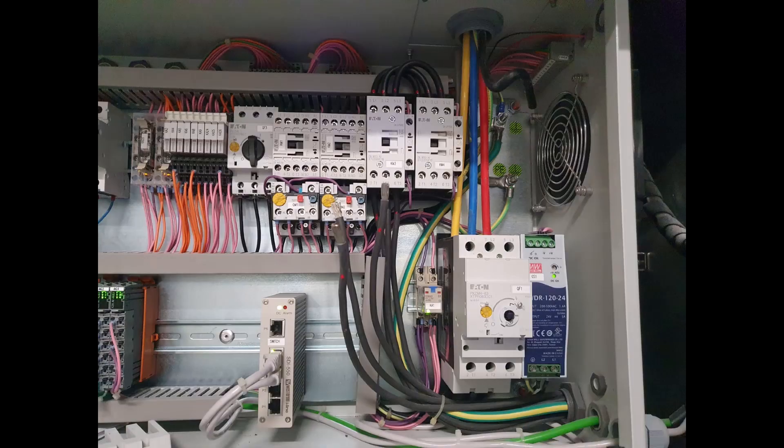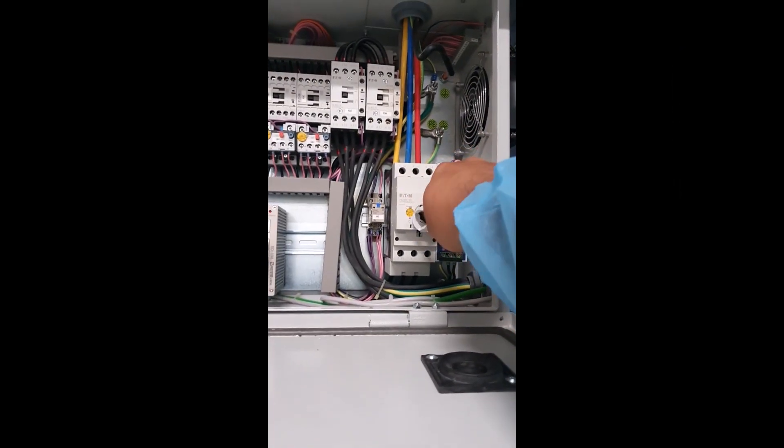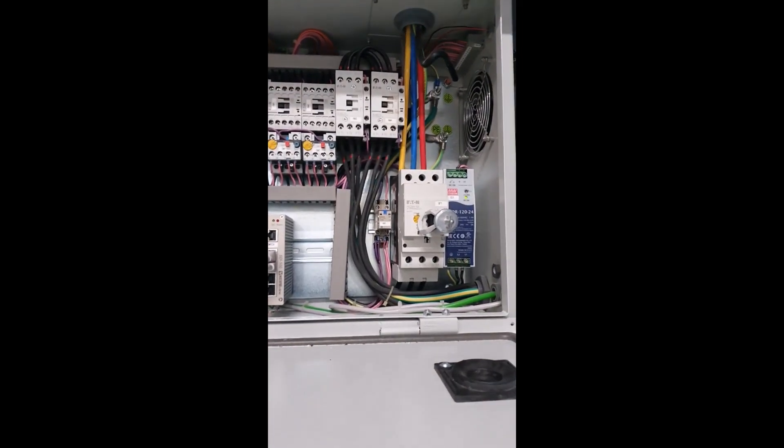You can see that the customer had disconnected the heaters and the isolator was not tripping anymore. I checked the machine and knew that one of the heaters is defective, but the unit has 3 heaters, so I needed to find out which one was faulty.